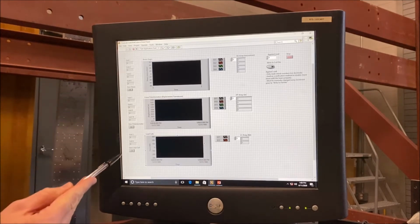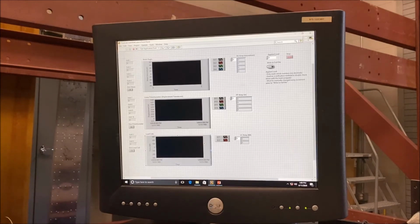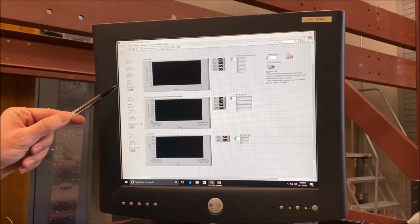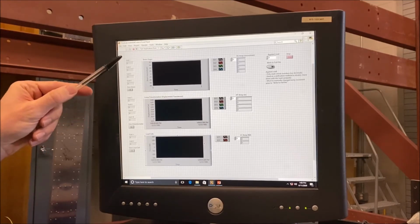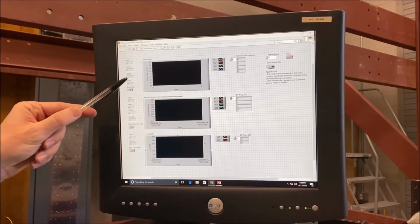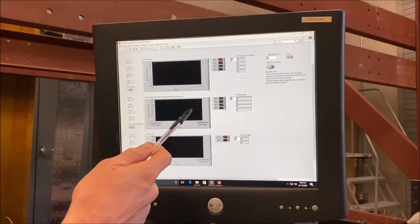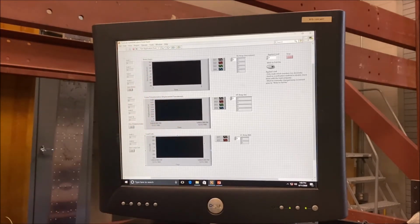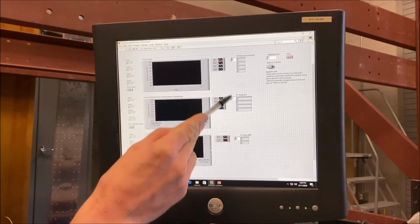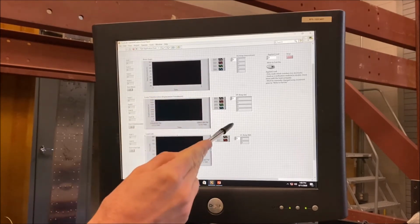If we look at these fields on the left-hand side, and we also look at the buttons that are associated with these, they are zero functions. So when we have a zero value of reading on the instrumentation before any load is applied, we're going to zero out the values so that we start with zero load, zero strain, and zero displacement at those initial readings. Once we've zeroed out our values, then we have readings that will be in relation to that zero value. As we apply load, these arrays will give us the values of strain, displacement, and load in the corresponding arrays.